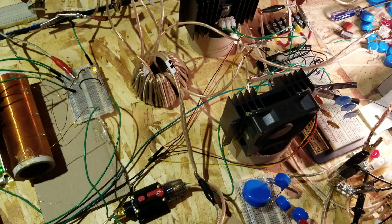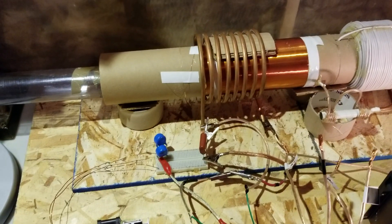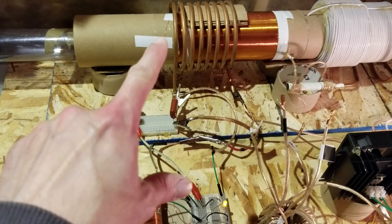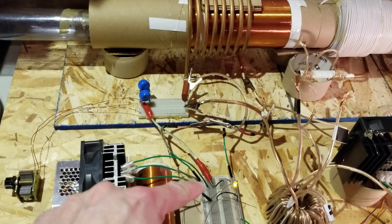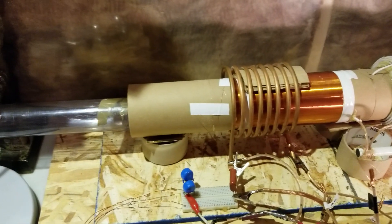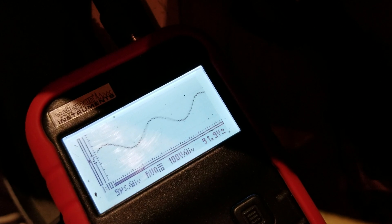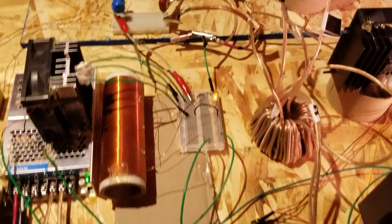One way I was also able to lower the frequency is with these two nanos in series with the base of the resonator — in parallel — and then going to the base of the MOSFET. This neon starts to activate basically when I get that ferrite rod to just the right spot, and that's where you start to see the trembling of this wave here at 25 kilohertz. Now I'll switch off the Tesla coil.